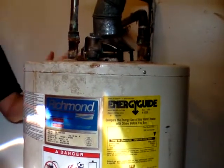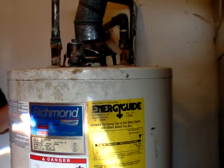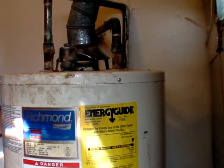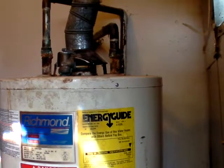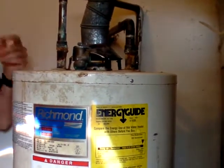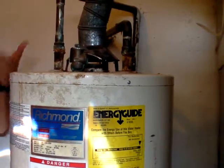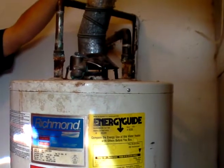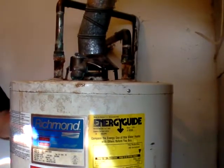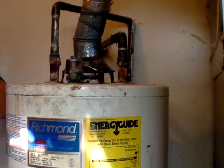All right. So what are we going to do? Let's just read through the steps. Number 3: test the smallest BTU capacity first. How do we know which is the smallest BTU capacity? You could look at the manufacturer's plate. General rule, the water heater is going to be less than a furnace. Even a small furnace, the water heater will probably still be smaller. But to make sure, look at the plates.